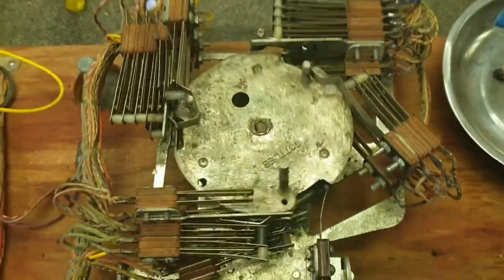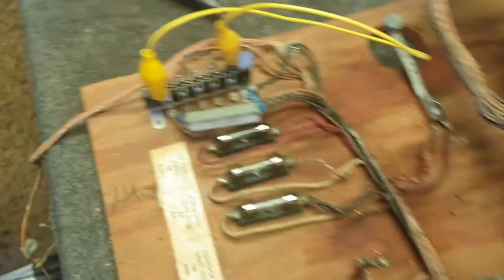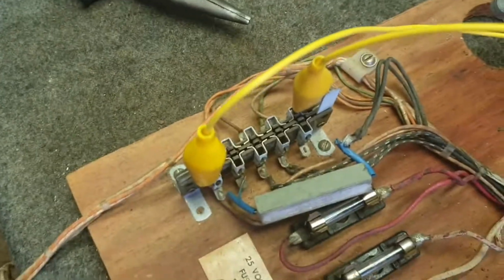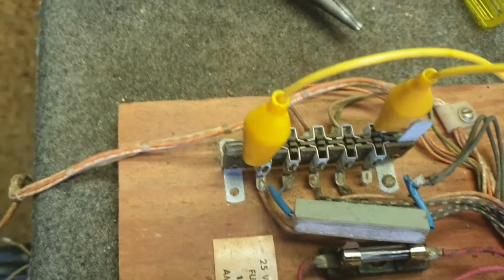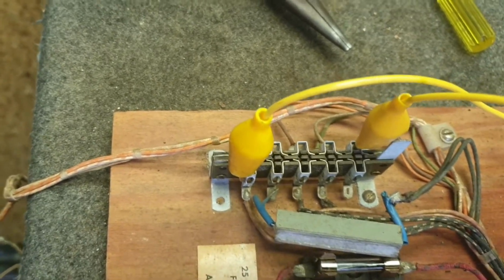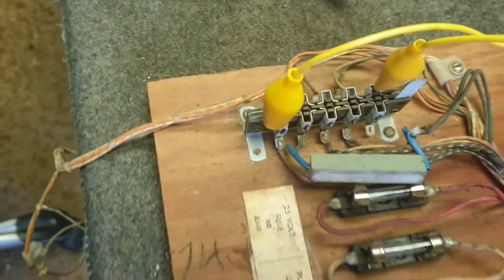Okay, so we've successfully put this motor back together and are just letting the lubrication run in. Now, just how to do that: you put a jump across the slam switch wires on the female plug, which is normally the top left and bottom right looking at it. Occasionally it is different, but that's normally where it goes.